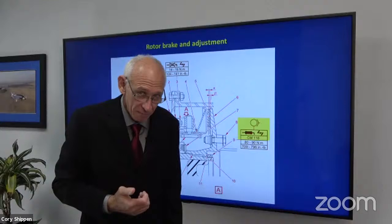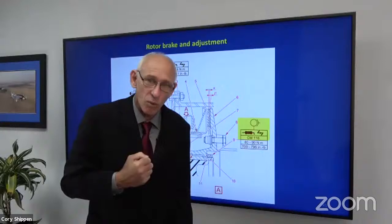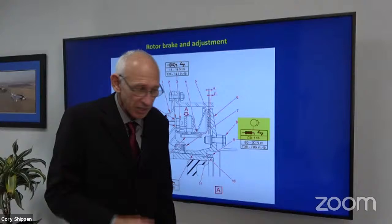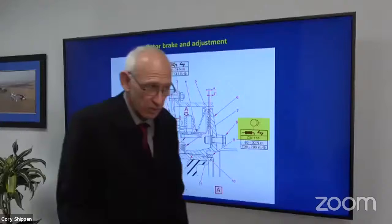You could essentially double the torque by adding that grease. And looking at it the opposite way, if you don't put that grease on, now you've under-torqued it by half. The drag torque, there's another one. Our books will tell you that you are supposed to fully engage the threads when you check the drag. Well, if you put one or two on there instead of five, and you say, okay, it's 40 inch pounds instead of 300, that's going to make a difference. So if we were to not add the drag torque, not put grease on it, and go, okay, here's my torque. Well, it's happened.